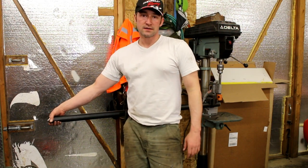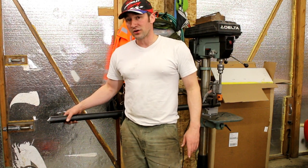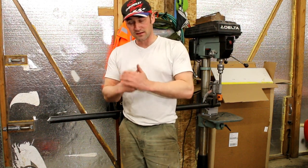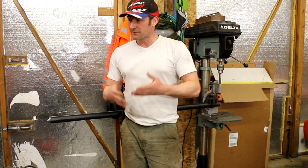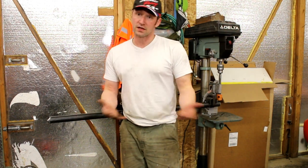You can grind these and you can cut these, you can swedge them. It actually takes a little longer and it's just not as tight of a fit. Because this is chromoly, if this was tube steel, I don't know if I'd bother with it or not for a few notches, if it was regular steel. But since it's chromoly and I have to TIG it because it's chromoly, I'm really going for a tight fit.